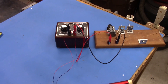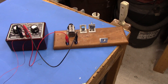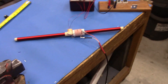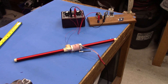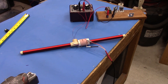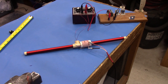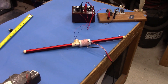I use a capacitance box to get roughly in the ballpark, and then I have a small variable capacitor - about 700 pF, 0 to 700 pF - in parallel with that. So basically this is what you're listening to in the other room. I just wanted to show you - please don't take this as the finished product, this is just one of my old coils I had laying around. I'll give you a couple of quick shots of what the antenna looks like when it's finished, and then we'll go into the SDR audio.